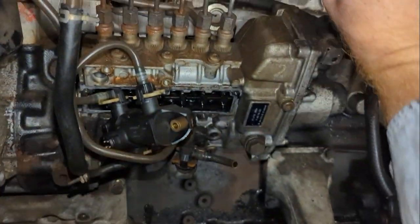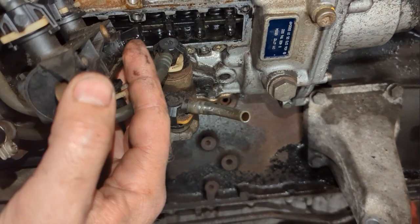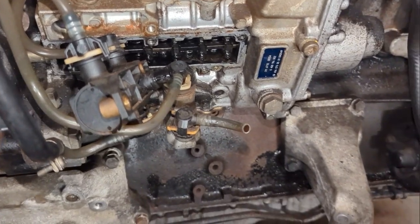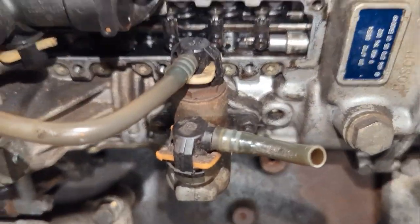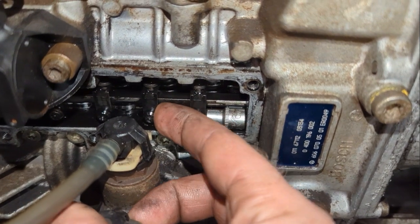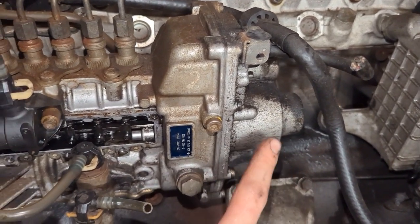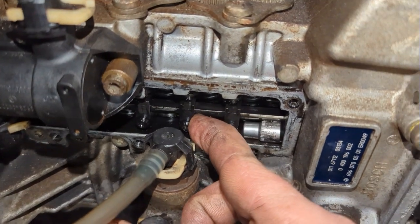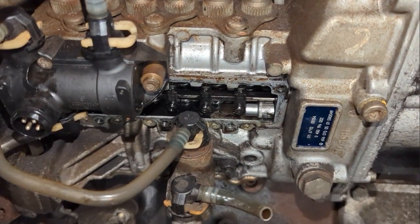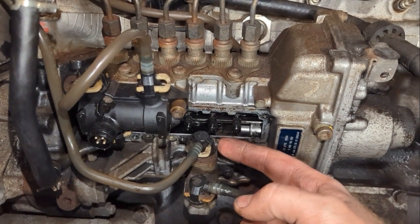It has a rubber gasket, and you can see what the shutoff valve looks like on the back — just a little inlet with an o-ring on it. Now that the rack cover is off, find something you can jam in there — this is just a socket. The rack always wants to be pulled back because there's no power and it's being pulled back by a magnet. Right here you can see that's pretty close to full throttle — I'd guess about 5,000 rpm. You definitely don't want to start the engine at 5,000 rpm, but you do want it forward enough to be able to bleed the system, so get it as far forward as you can.